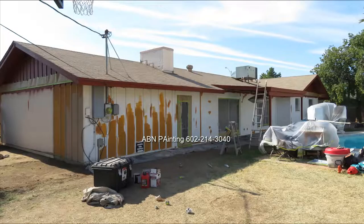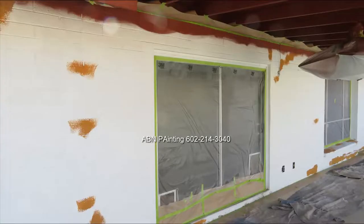To spray paint the body of the house, we masked the trim with 12 inch masking paper, covered all the doors that we are not painting, the windows, and some furniture on the patio that was too heavy to move we covered with plastic. We covered the concrete right next to the house using 12 inch masking paper and then covered the rest of the area using tarps.